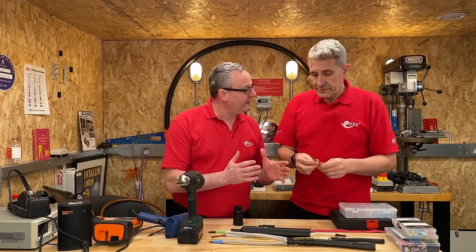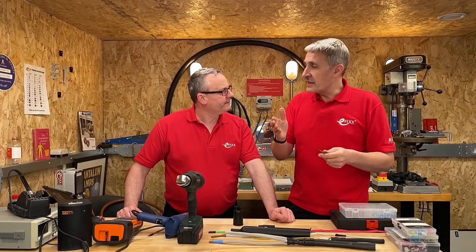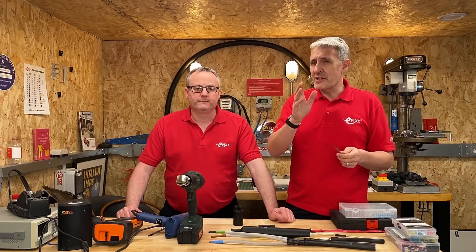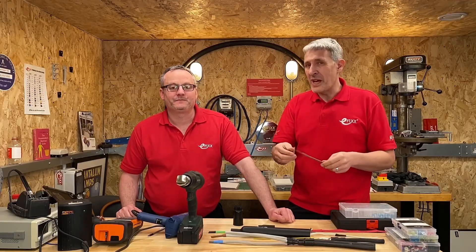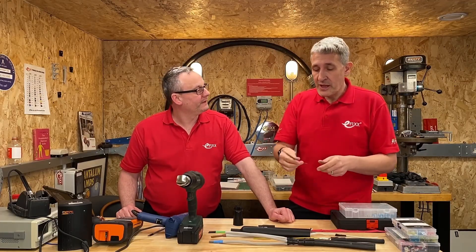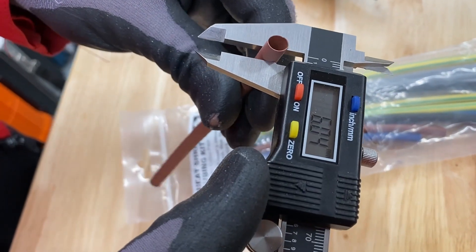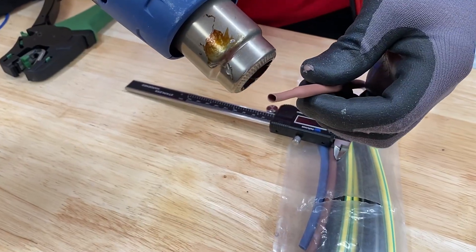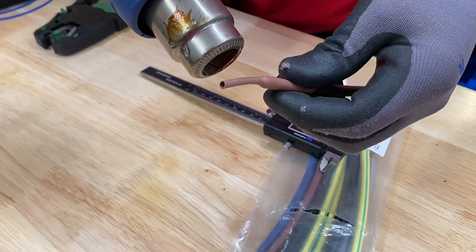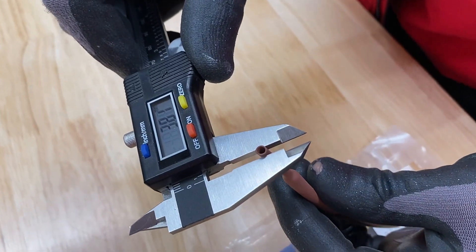So that was a 3-to-1 ratio — what other types are there? Lots of different types, but the highest ratio I've seen is 4-to-1. If you find one that's higher, possibly 5-to-1, put a comment below with what you use it for. This brown version here is a 2-to-1, starting at about 6 millimetres and shrinking down to 3 — possibly something you'd put over the end of a conductor to mark it for a different purpose than the colour might originally have indicated.